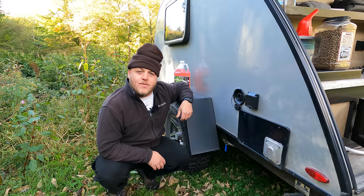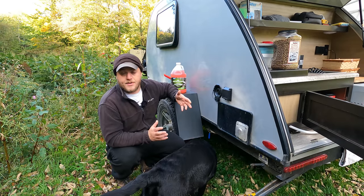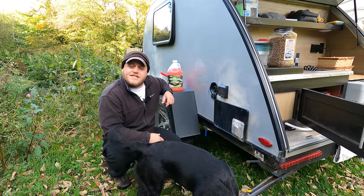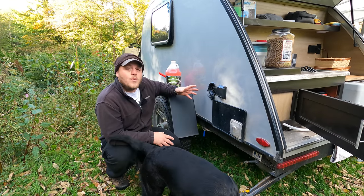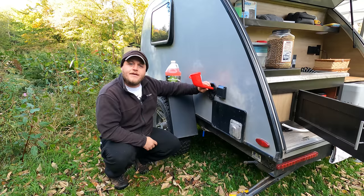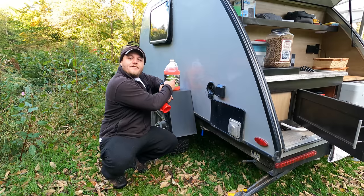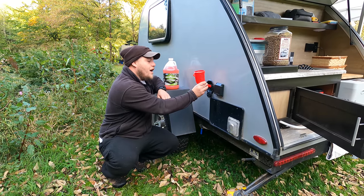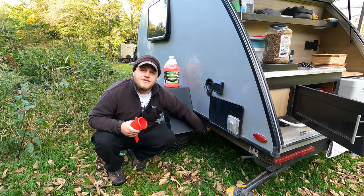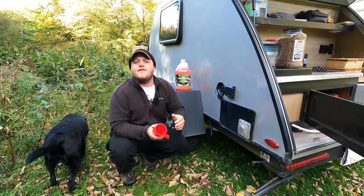Mine is now an open pathway, so I'm confident that section of the trailer is winterized. If there's a small amount of water in the reservoir, there's room for it to expand and you're going to be okay. If you want to be safer, you can take an offset funnel and add a little bit of antifreeze here — a cup, two cups, or a whole bottle. Note: I'm working around my dog here, so be careful, because this stuff is not very good for animals. If you're going to pour a lot, it's a good time to turn your low point drain off so you don't pour antifreeze on the ground.